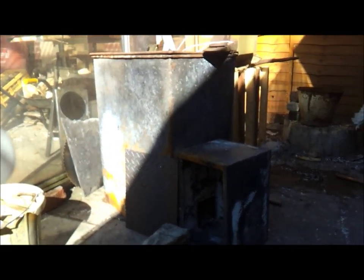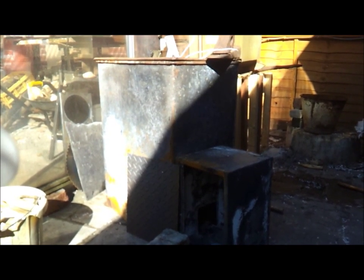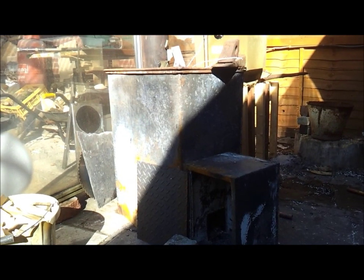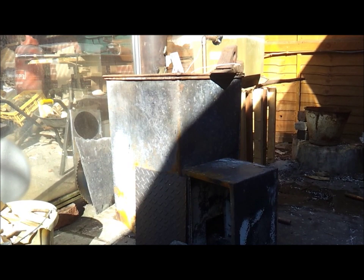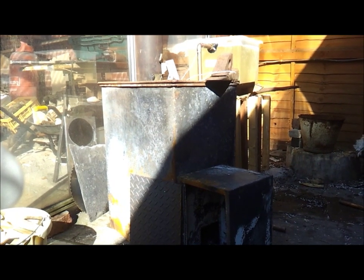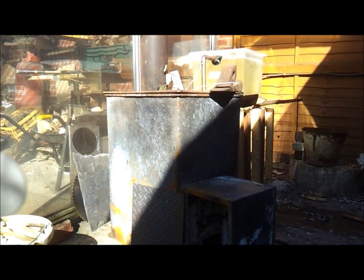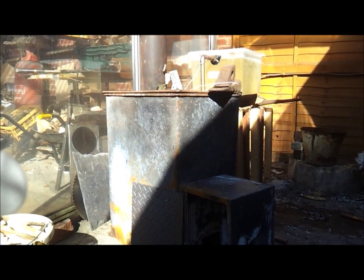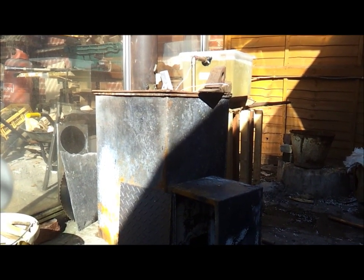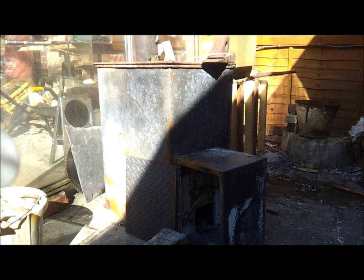As I've said before, I'm not totally set on this bell-shaped boiler. I can see problems with it really. I think the main obstacle is going to be the condensation from the burn — the moisture that is hitting the boiler and then dripping down, which will be inside the stove. So I think this may not be the right way to go, and I think it's just going to be a simple coiled pipe heat exchanger that's wrapped around the riser or wrapped around the inside of the actual rocket chamber.